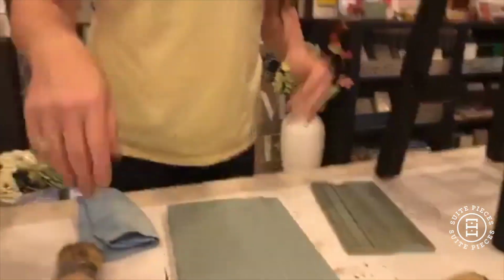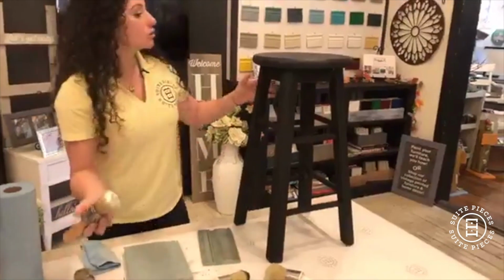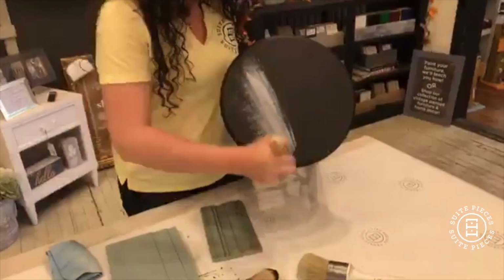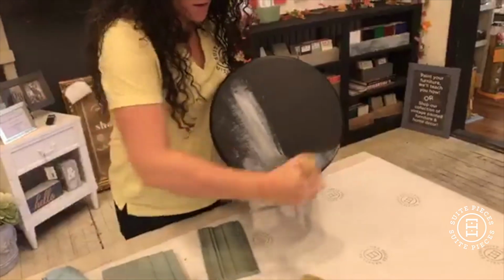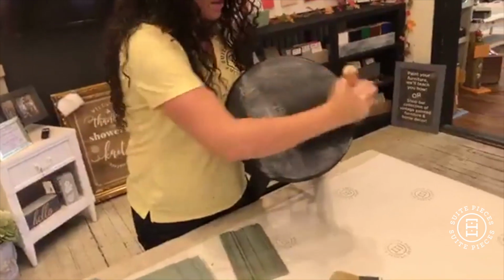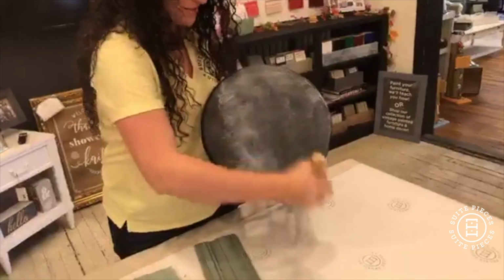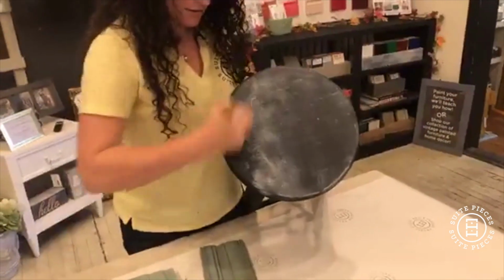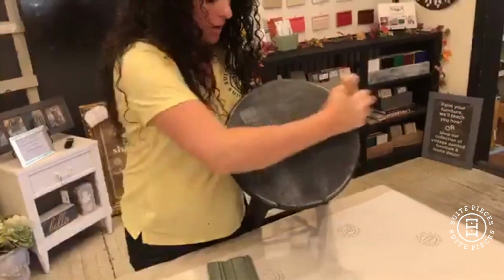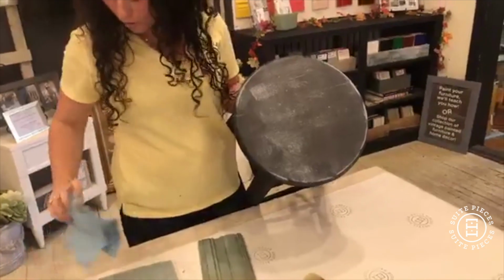So now let me show you on the top here of the black. Since Julie brought it to my attention, I have something nice and dark here to do. So I'm just going to kind of rub this. And if I hate this, once I do this, what would I do? There you go. You guys pass. You get an A today. Just use the clear wax to erase it. So this kind of gives it like an old chalkboard almost.